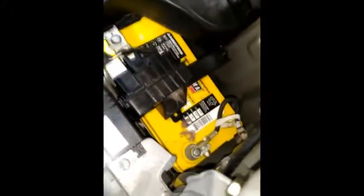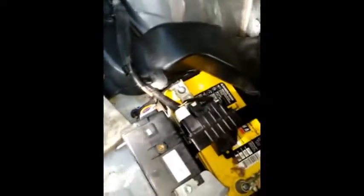I am thrilled and just wanted to share this. These are tricks I picked up from years of working with batteries. Hopefully this saves someone out there $220 or more. I know people who use AGM batteries in boats — you can flip them over and they're fine — and in RVs because they produce no fumes, and in solar power systems. But I think solar is 100% the wrong application for AGM, because if you go below the recommended minimum voltage even once or twice, you're significantly harming that battery.